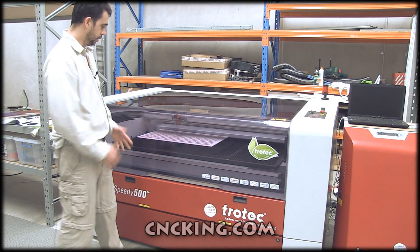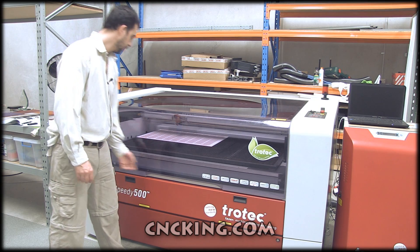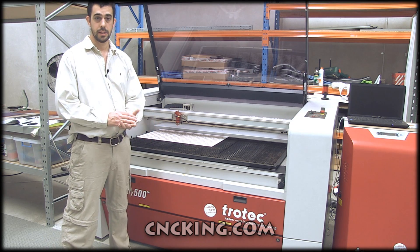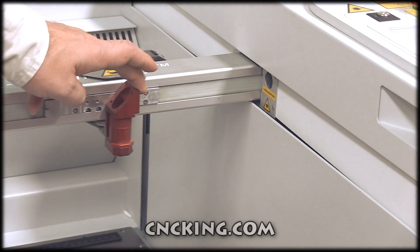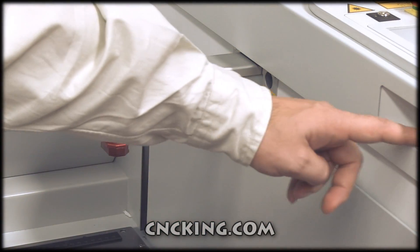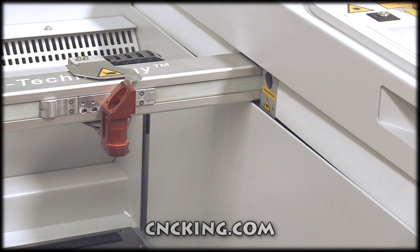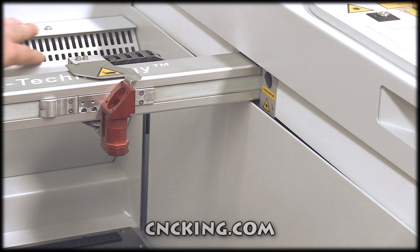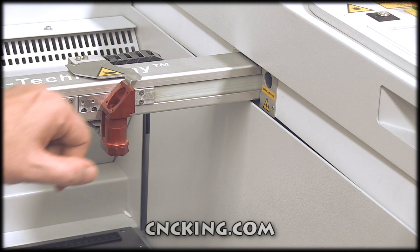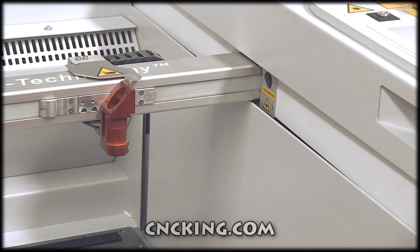At the same time, it's very easy to use. You can see your whole project, and you won't suffer from smoke inhalation because the extraction is excellent and everything is very well contained. Now looking at the 400 head — it's a lot smaller than the 500. You have the impact technology and the ribbon cable, plus LED lighting so you don't need a flashlight to see your work being cut or engraved. Extraction is through the back, and the slotted design means you can cover unused areas with masking tape to focus extraction exactly where you're engraving or cutting. This machine moves at 4G acceleration, 355 centimeters per second, while the 300 moves at 5G — also 355 centimeters per second.